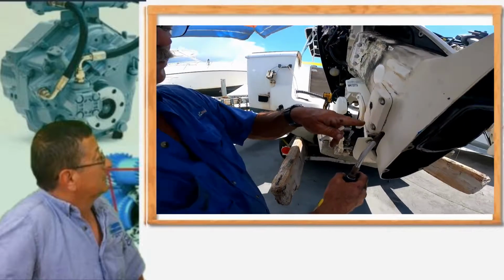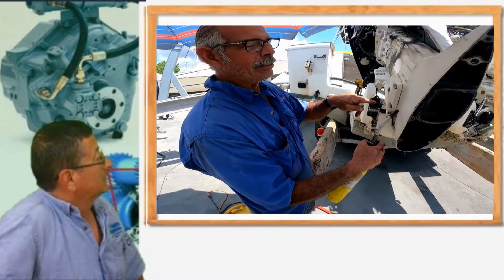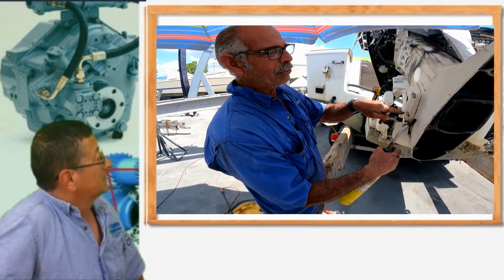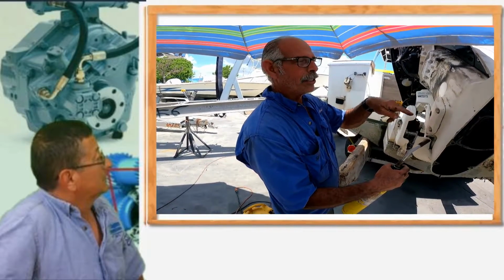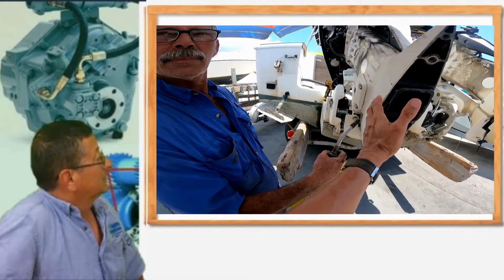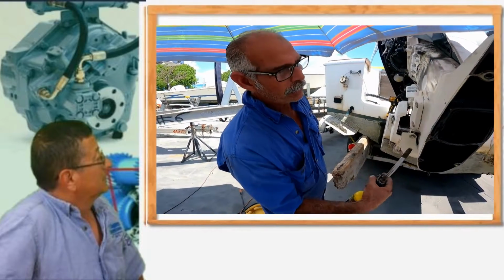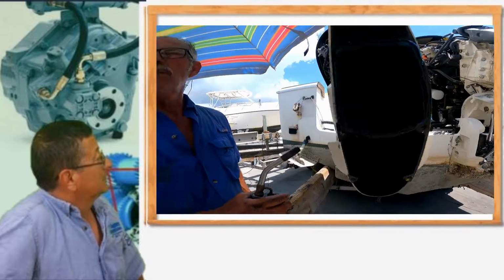You heat the back of the bolt as much as you can because oil or lubricant gets attracted to heat. So you actually heat the back of the bolt as much as possible, so when you spray lubricant in the front, it absorbs into the nut. Robert, are some precautions necessary when you apply the heat, because you can damage the lower unit, no? Not here. There's nothing here. Everything is metal. So okay, we're good. You don't have gasket. You don't have nothing over here.